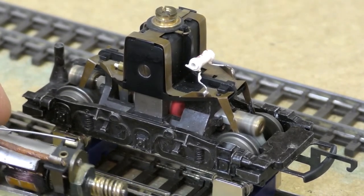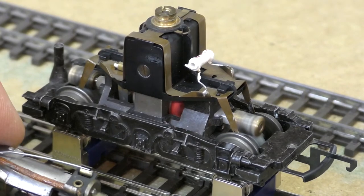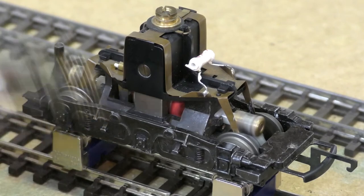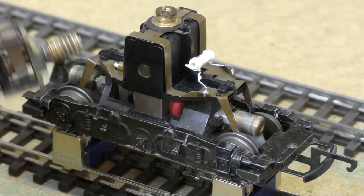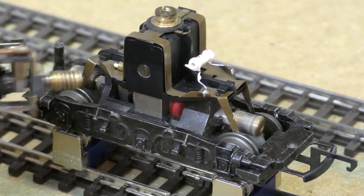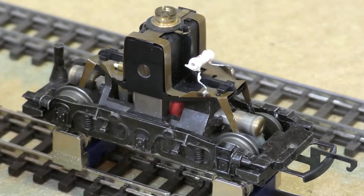So I had a little think about it. I thought, I'm a long way round with this conversion — I'd better carry on. It'd be a shame to give up. So there's only one answer really: I've got to advance or retard — whichever. I don't think it'd make any difference. But I've got to change the timing on this armature by 90 degrees, to bring the current from the brushes in line with the magnetic force from the pole pieces so we get a nice smooth rotation.